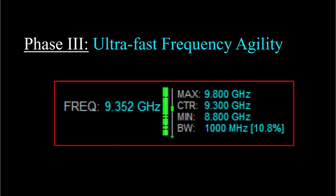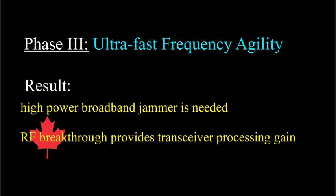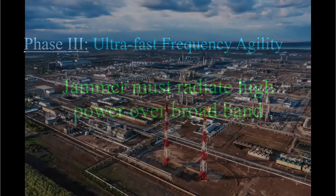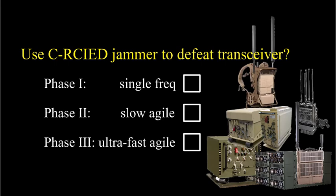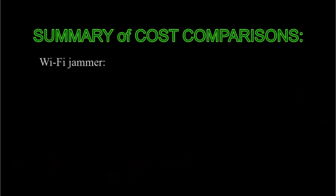In phase three, the communication link uses the RF breakthrough for ultra-fast frequency hopping. Broadband hopping means a high-power broadband jammer is needed, but the RF breakthrough also provides considerable processing gain, so even more power is required to overcome that. The 100-watt ERP figure won't do the trick. Such a jammer would simultaneously shut down those bands for all equipment — friendly and hostile — which seems unlikely as a long-term option. Could the enemy use a counter-RCIED reactive jammer against the phase three transceiver? That type of jammer probably would work against phase one and phase two transceivers, but it's unlikely to work against phase three. The phase three frequency hopping is just too fast — transition and dwell times are faster than the jammer's expected single-digit microsecond reaction time, and it's hopeless if the jammer's reaction time is double-digit microseconds.